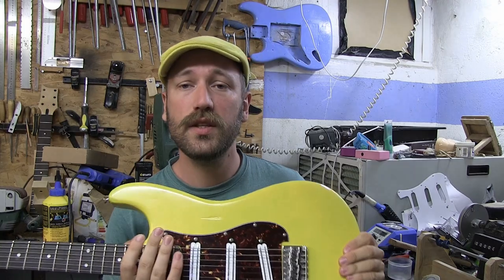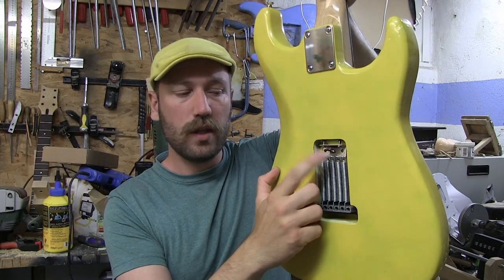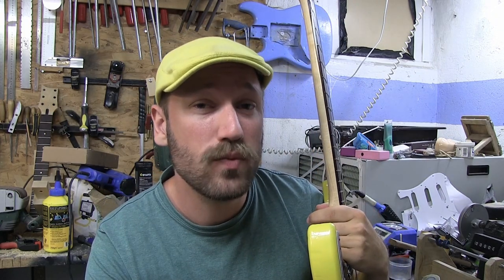And it's going to be super easy to do, and I'm going to show you how to do it. What we need to do is take off the pickguard. There are going to be two cables that go to the output jack, and we need to unsolder them. There is also one going to the claw right here, and that's our bridge ground connection, and we need to unsolder that one as well. I'm going to assume that you already know how to take a pickguard off and how to unsolder the ground connection and the lead connections. If you don't know that, let me know in the comments below and I'll tell you in another video. But in this one, we're just going to skip ahead till when the pickguard is already out.